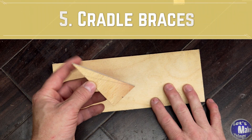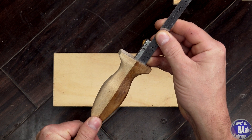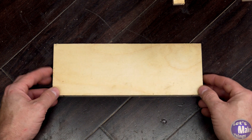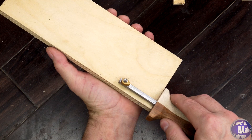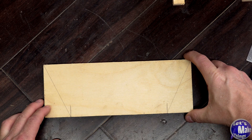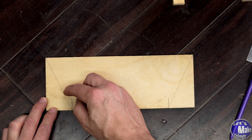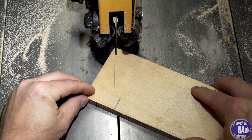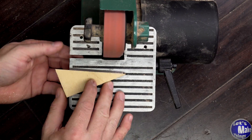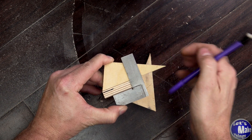Now we need to make the 25-degree braces. First, we're going to come in 3/4 of an inch on either side of a longer stretched-out piece. I'm going to set this to 3/4 of an inch and come to the edge and draw my line. Next we can flip this down — we'll set our marking gauge to 1 and 17/32nds. I'm going to mark each side and now I'll connect the corner with the line I just drew. If your stock is 3 and 5/8 inches wide, then this will be a 25-degree angle right here. We need to cut this out on the table saw, but we want to make sure we're not cutting on the line at all. We'll come back and clean that up later on. My pieces are going to line up like this, but I don't want to have this giant corner on the end, so I'm just going to cut it off now.